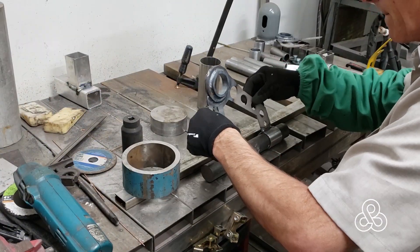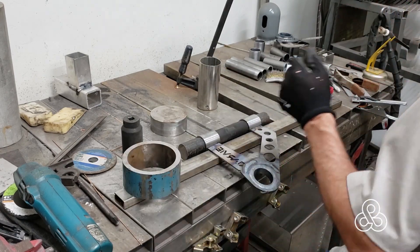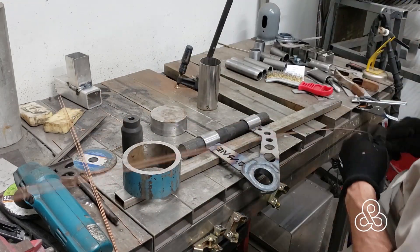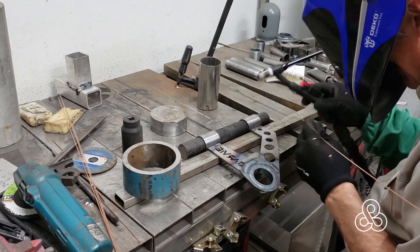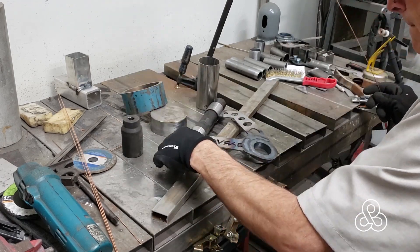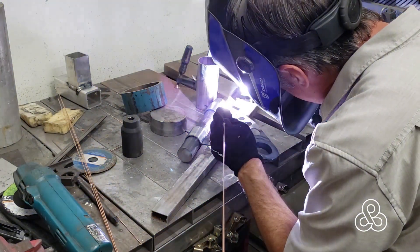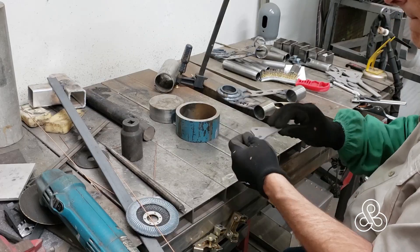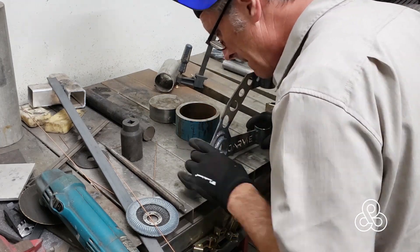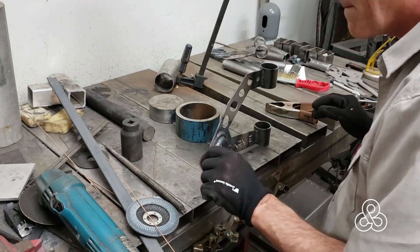Using the same method as the rear upper control arm — I have a solid metal bar going through those pieces of pipe so that the heat does not blister through, because we need those to be smooth inside for the bushing. Get it set up and weld those in place. There's just a little bit of clearance on those bushing tubes to allow the flat bar to go right onto the edge. The first piece is not flat bar but actually a water jet cut part because it has a little tab that sticks up.